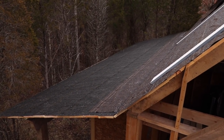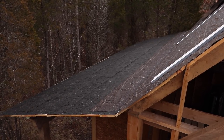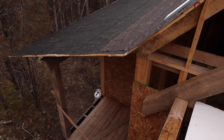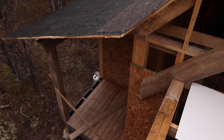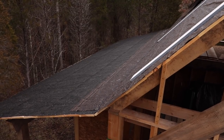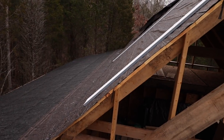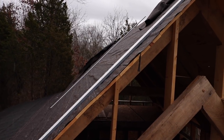I'm standing on the roof of the bedroom and we're looking at the shed roof bump-out off the back of the main 14 by 20 cabin area. This is a little 6 by 6 back porch where you can come in and get out of the rain or snow, take your boots off. I've got this covered with a peel-and-stick membrane because this is a bit of a shallower pitch — it's a 4 and 12 — so you want a little extra protection there. Then you've got 15-pound tar paper here that's really just temporary.